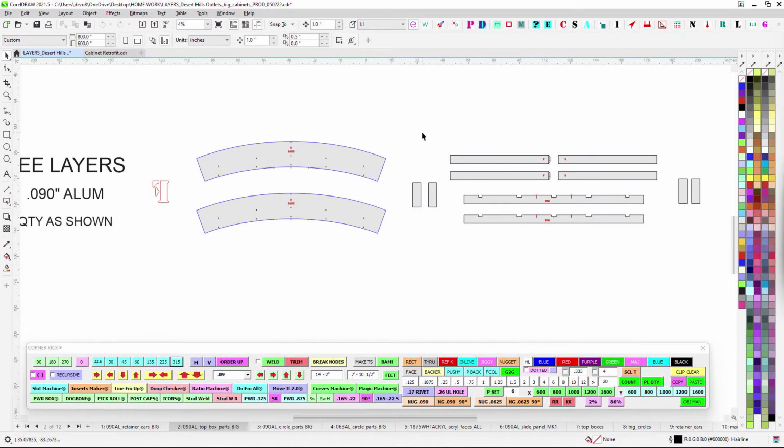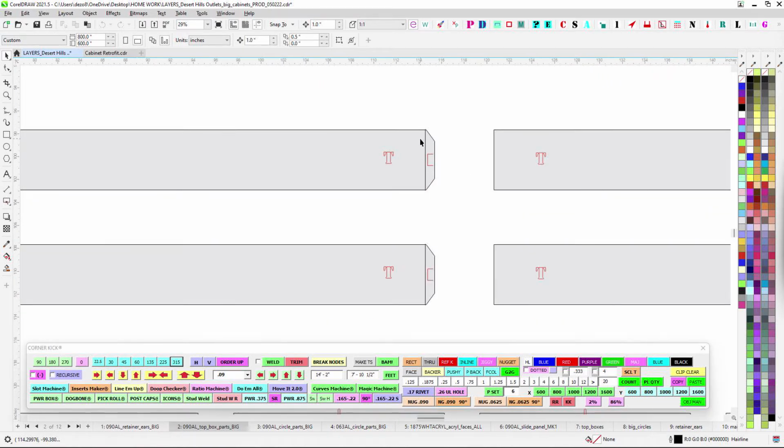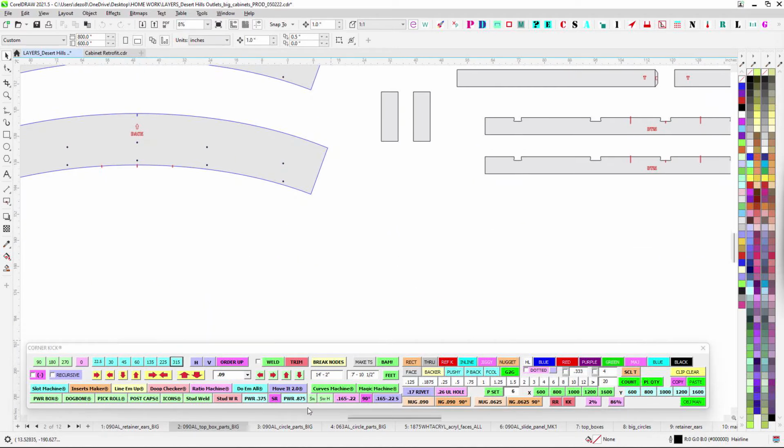And this is your two cabinets, the two top cabinets. These are essentially like we do regular channel letter, except not reverse channel. The returns go on the outside, so we'll go over that. But again, look for some inside reference kiss marks on those. And then you'll have a bend scribe for a weld point there for the seam up top.